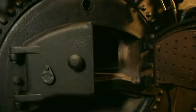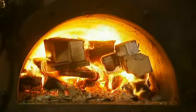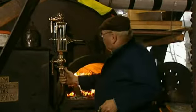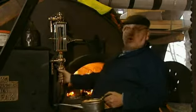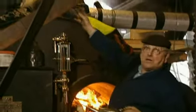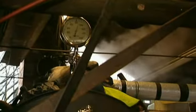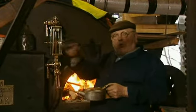You only have a fire in here a few times a year, but at home I've got steam up most of the time. It's very important to know where the water level is, and this particular bit here is the water gauge. When you open this valve at the bottom, the steam pressure inside forces the water down. And of course when you shut the valve, it's forced in at the bottom by the water pressure below the steam, and you can see it rise up again. A bit higher up is the pressure gauge — a great clock with a steel spiral tube inside it. When it gets up to pressure, it works a quadrant and a rack, and registers on a needle the pounds per square inch that's in the boiler.